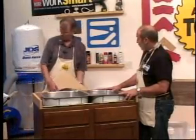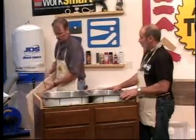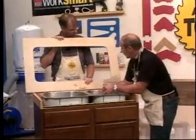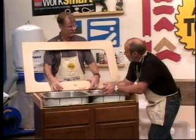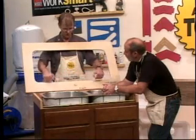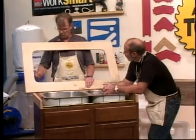Briefly, usually what these are, and let me show you a kitchen bowl. When I was in fabrication full time, we always used to take those templates and make templates like this out of them, which the idea behind it was we could take this. This already was the setback that we wanted on a typical installation. So our guys could just find the center line. This right here was parallel to this. So they would just put this to their front edge, clamp down the corners. Once that was done, all they had to do was run the router around it.